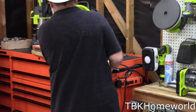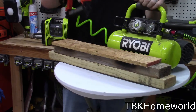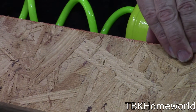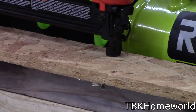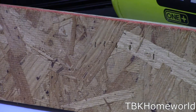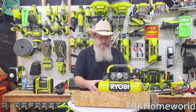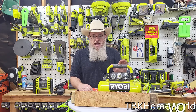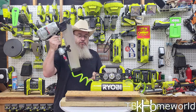Crown molding is going to be much thinner than this test wood, but let's see if we have enough pressure to drive a crown staple through it. There we go — yes, we do. I fired one and the pressure didn't drop enough to kick the compressor on yet. Let's keep firing until the tank drops enough pressure that it needs to cycle back on. We got five crown staples in before it had to kick on — that's actually pretty decent for a one-gallon portable compressor.